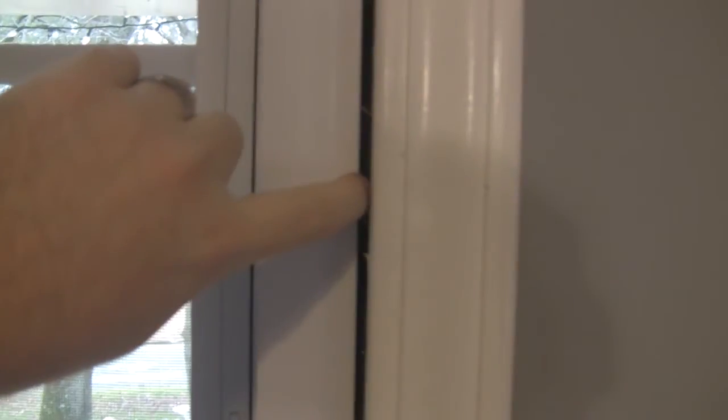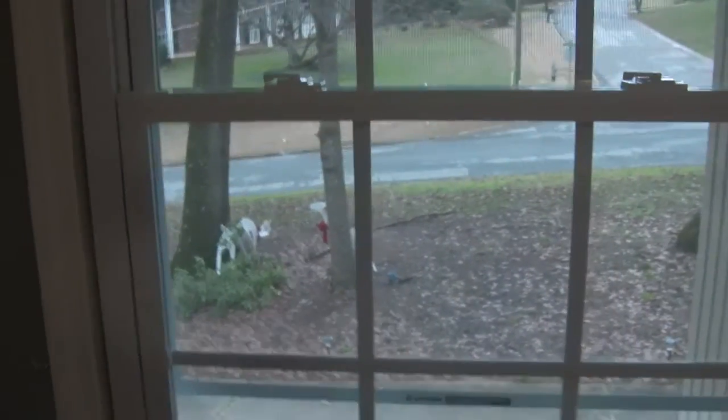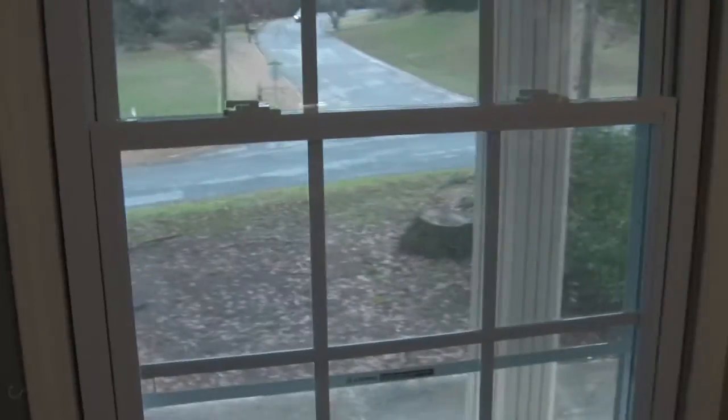Now we have to... I'm just making sure that it's kind of even here on both sides. So the spacing that he was talking about, I know I was just kind of flying through it, but it's actually located on both edges of the windows. You'll see it's about a fingertip here. And then go over, same here. He's going to bring a level in more just to make sure that we are going to be able to slide open and close easier, which is always a good functioning window. Use a level often, checking every side and making sure it's square.